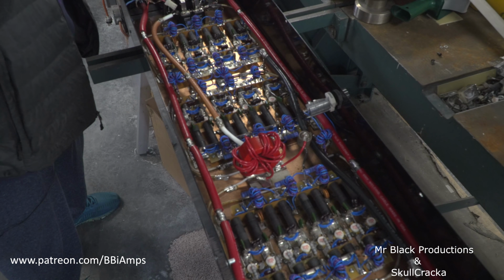And I realized when I was doing it that trying to do a Wilkinson on this heatsink is impossible. Right? It's possible, but you're going to have a lot of stray inductance because you're running some combiners here, some over here, some over there. There's no center point. If I were to do a Wilkinson, I would have to turn these to where you'd have two facing this way and another two facing this way.